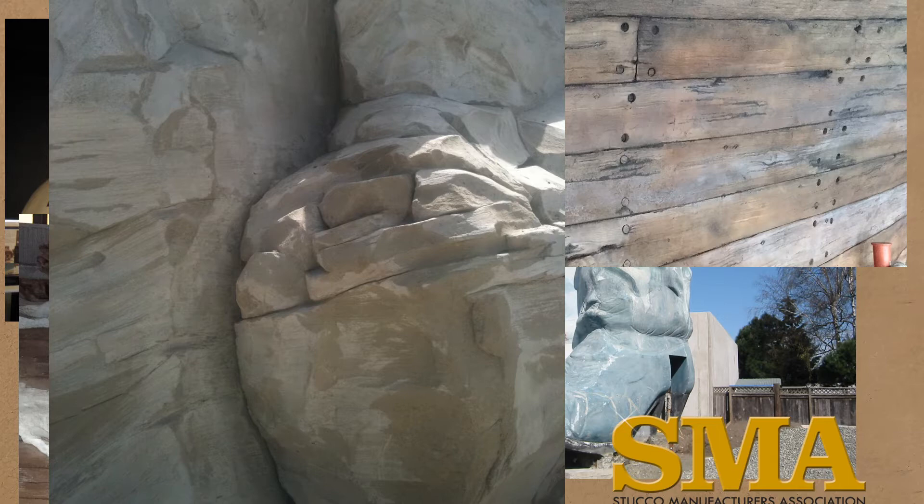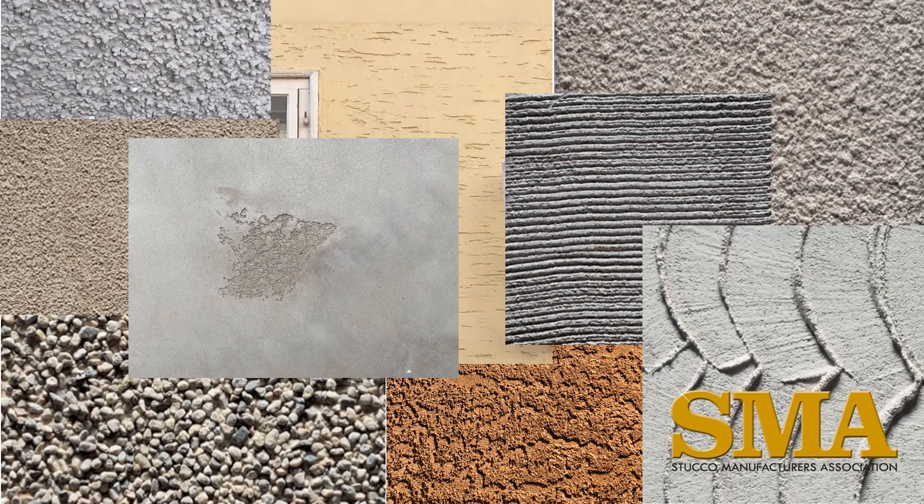A chip can be shaped and colored with a cement-based paint similar to fog coat. Stucco is unique in that there is a wide variety of textures and each plasterer and region can have slight variations. The most common texture is the sand or float finish, determined mainly by aggregate size: 16-20 is a medium finish and 20-30 is a fine float finish. Lace or Spanish texture is very popular as it is fast to apply and hides imperfections. The Mission or Santa Barbara finish is a smoother finish incorporating random cat faces. The machine or dash finish is a stipple look achieved by spraying the finish onto the brown coat.